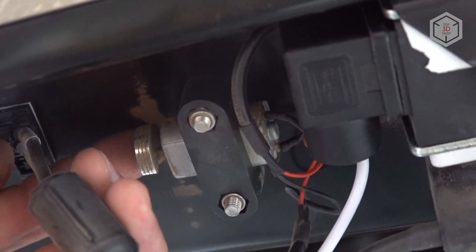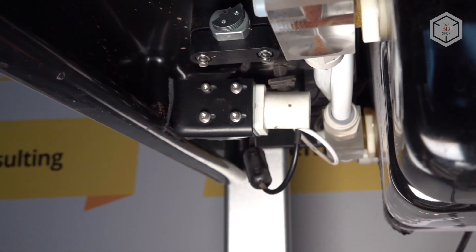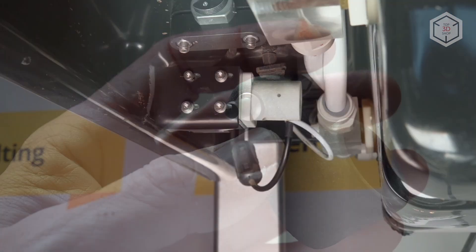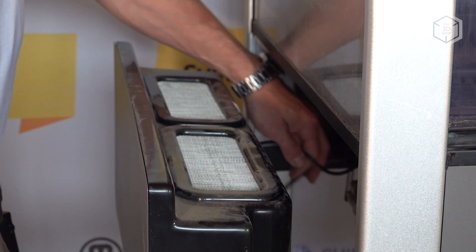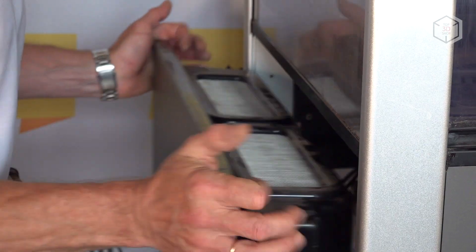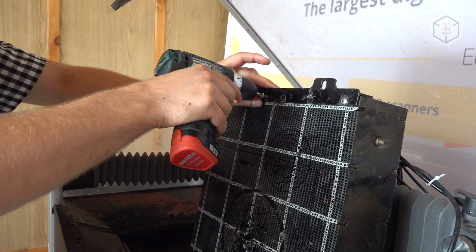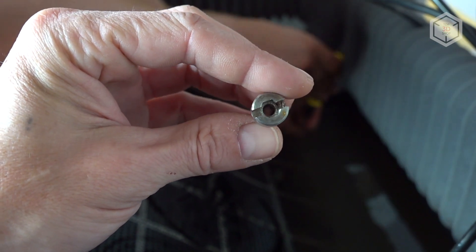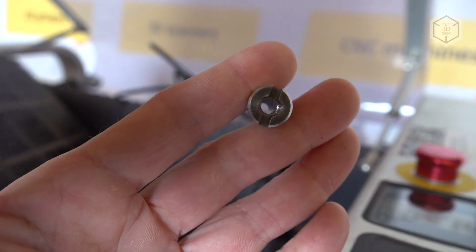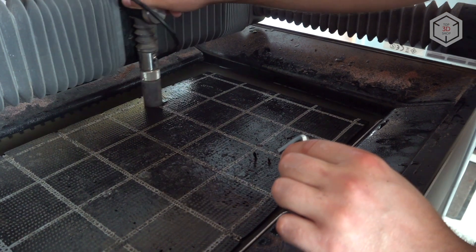Garnet is sifted through two metal grids into a plastic hopper with two vibration motors at the bottom. The lower part of the hopper forms a funnel with a metering pinch valve similar to the one in the drainage system, and can be adjusted manually during maintenance. A rubber mixing chamber is connected to the bottom of the valve with a reverse slope air intake — the reverse slope prevents garnet from leaking when the machine is shut down. Similar to 3D printers in principle, the axes are driven by stepper motors through toothed belts. The honeycomb-shaped bed is fixed through two intermediate plates that can be disassembled, allowing you to turn the bed over and use it until it starts falling apart. The fixing allen key bolts are submerged in water and small holes are drilled through to prevent the caps from clogging with abrasive. The bed supports are spring-loaded, and by tightening the screws, you adjust the level of the surface to approximately the same height of the head movement pattern.